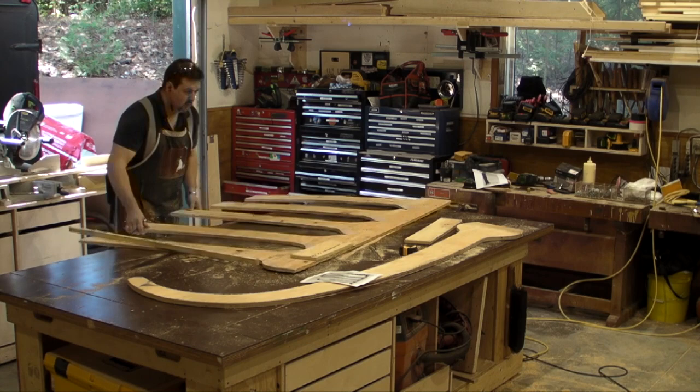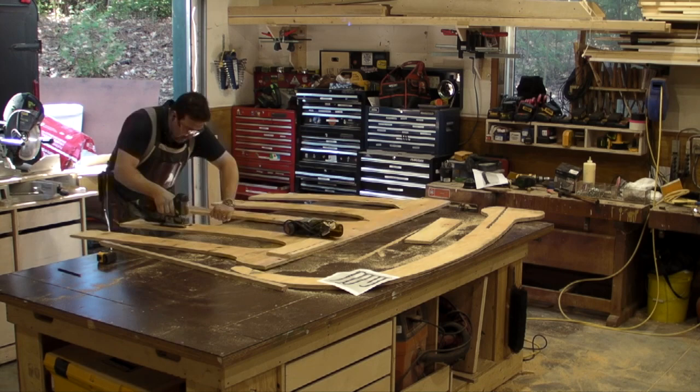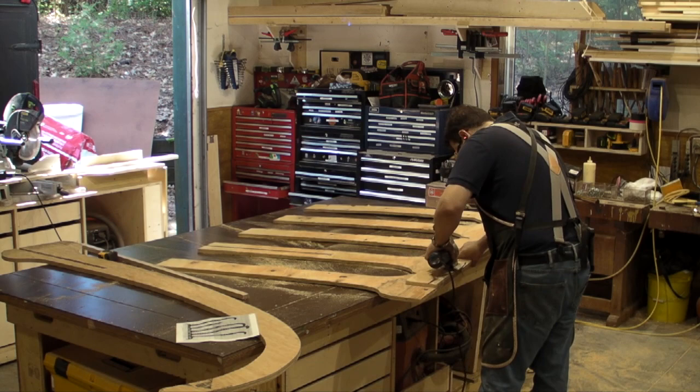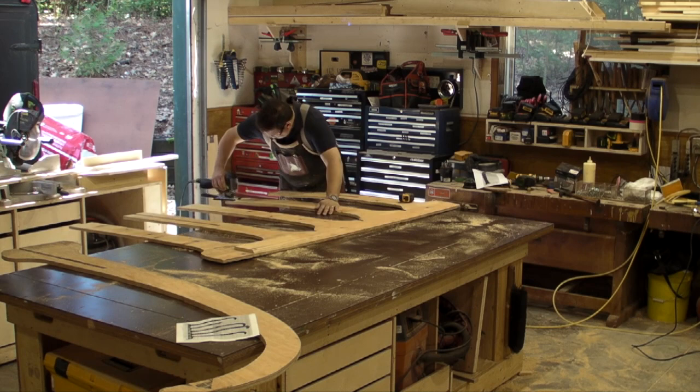The way I'm putting these together is they're kind of finger-jointed. I cut a profile slot that's three-quarter inch wide — you can see it's on a bit of a curve and the other piece is also three-quarters of an inch wide — so these pieces just slot together. With a couple of strategically placed screws it ends up having some base structural integrity, which is then backed up by the gluing, the styrofoam, and eventually the parging at the end.